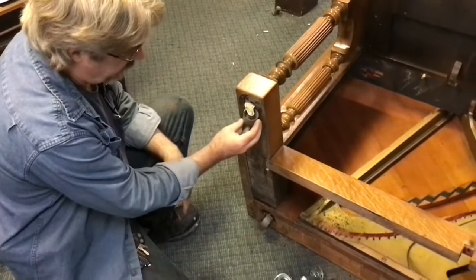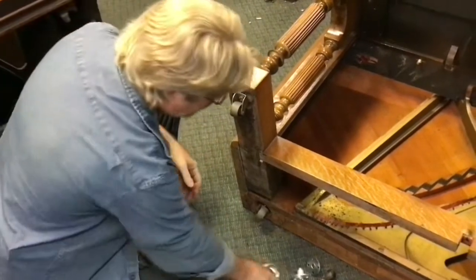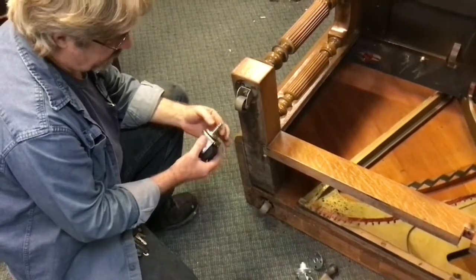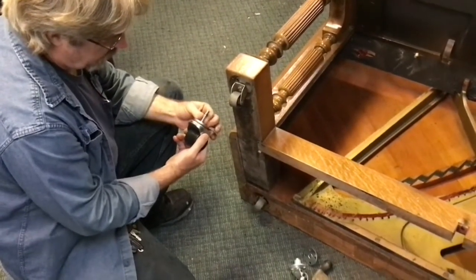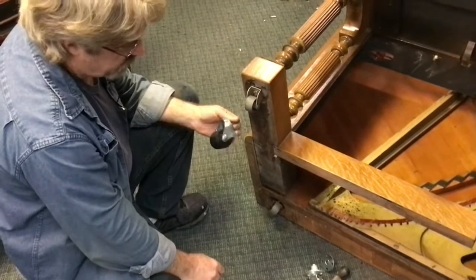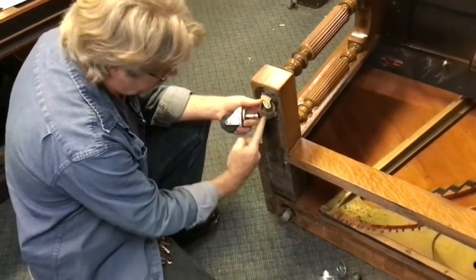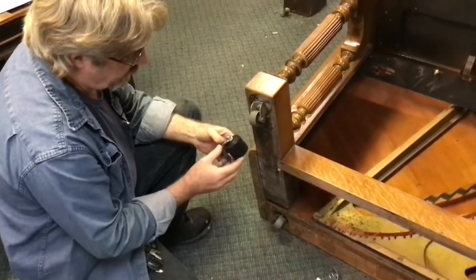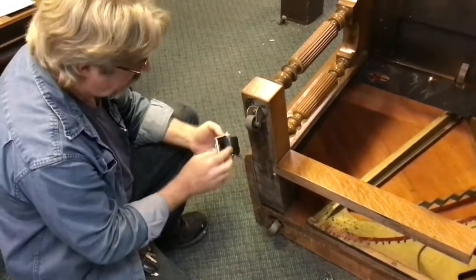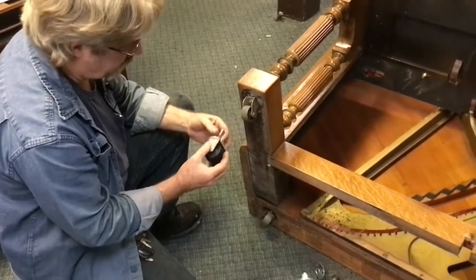Casters is something that definitely needs attention while you've got the piano tilted. In many cases we like to replace the casters with a more modern caster that has either a plastic or even a rubber wheel, and also has a ball bearing swivel like this right here. This enables the caster to swing around into position for the wheel to roll. That's actually a common way a lot of floors get scratched — they don't swivel properly, it stays locked in position, and when you drag it the wheel drags an edge on your floor. I do have a video we'll put a link to in the description, and maybe pop up one of those little magical boxes for the caster replacement video. That will go into far more detail than what we're going to discuss here.